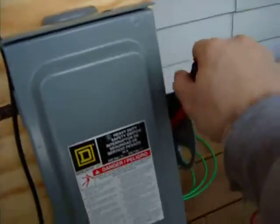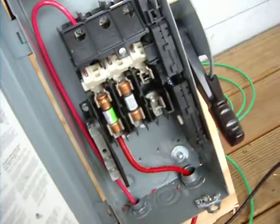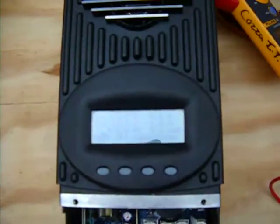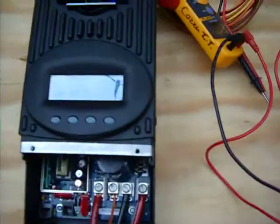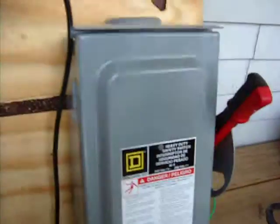I'm going to have to shut it off, which I'm pretty sure is going to power down the charge controller. We're really only using one of the three poles in that. The charge controller is still running — it's either got some battery life, or at least the battery needs to be turned on to initialize it. Simply turning on the PV does not initialize the charge controller, so you almost certainly have to bring that back on.